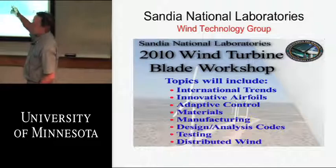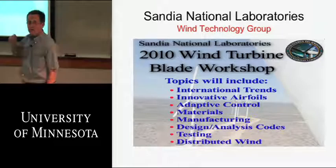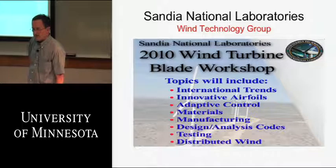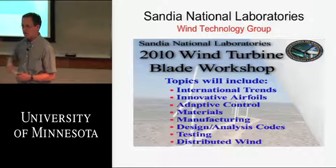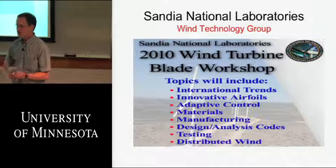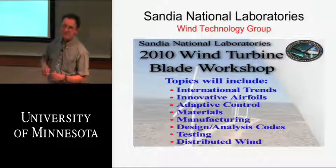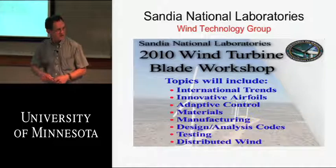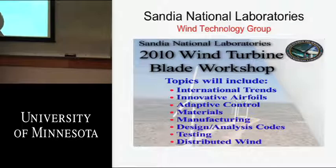Airfoils, this is the shape of the wind turbine blade. They still optimize the shape, the curvature, the twist, all that affects it. I remember when I was visiting Sandia National Lab, they experimented with a slightly different orientation of the fibers in the composite materials. They claimed at that point that they can gain something like 1% more energy just by aligning fibers a slightly different way. 1% doesn't seem like much, but given the size of the entire industry, that translates into a very significant amount of money. So this is the material part of it.